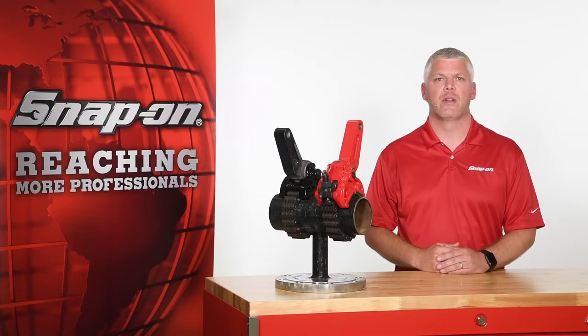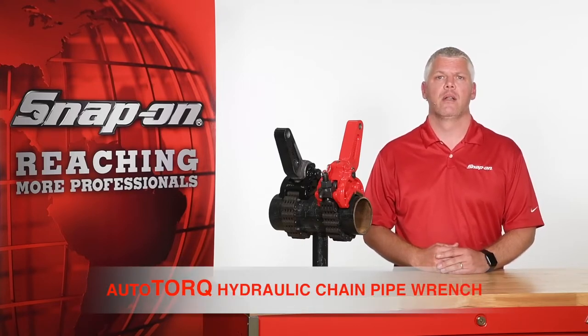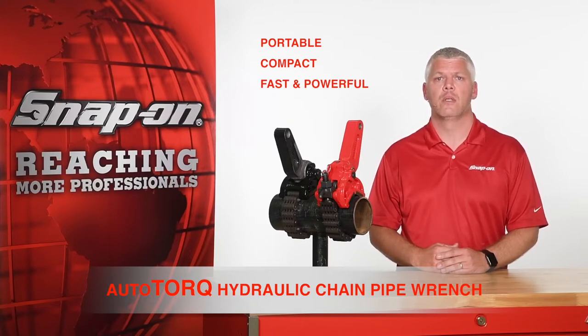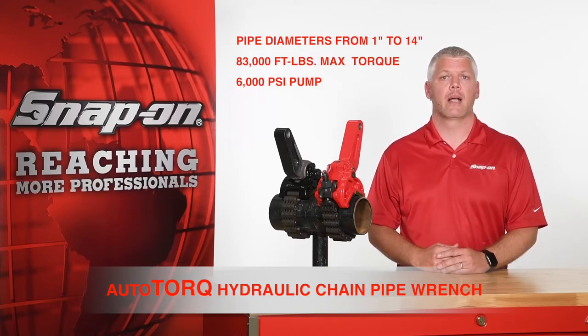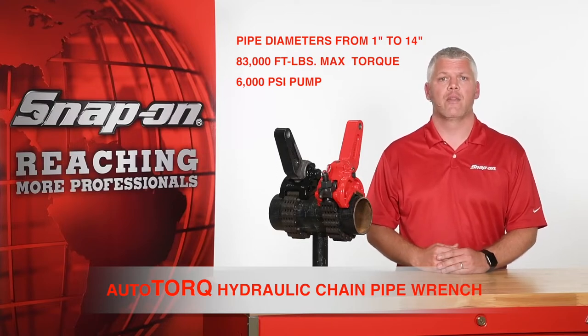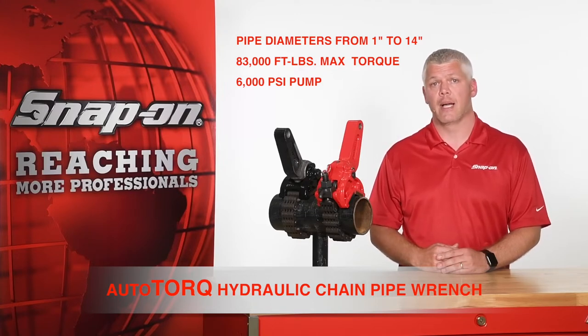Today I'd like to introduce one of our newest products, the AutoTORQ Hydraulic Chain Wrench. The AutoTORQ Chain Wrench is a portable, compact, fast and powerful tool for making and breaking threaded pipe connections, replacing tongs and other high-risk methods for performing these tasks. With five models to choose from, AutoTORQ Chain Wrenches can accommodate pipe diameters ranging from 1 to 14 inches and can provide a maximum torque of over 83,000 foot-pounds, using a relatively low 6,000 PSI hydraulic system.